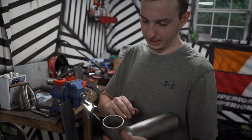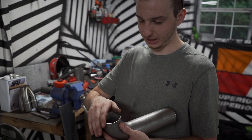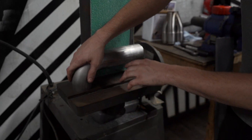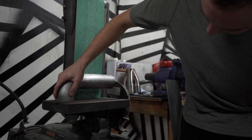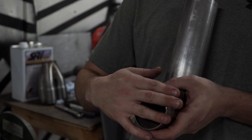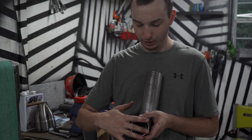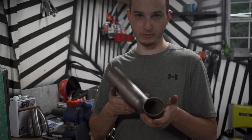What we want to do now is get this as perfectly flat as we can possibly get it. I'll just put it down on my table — if it's not flat, it'll rock a little bit. As we're sanding, if we stay in the same place, the belt's going to put a grain across it. When we're done, it'll have one smooth grain going straight across and we'll know it's flat.